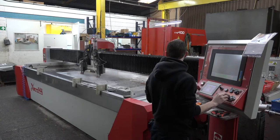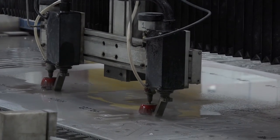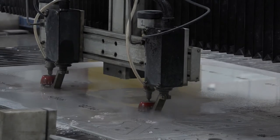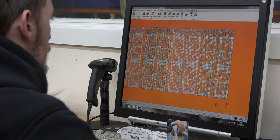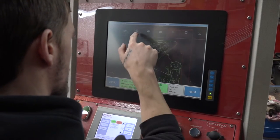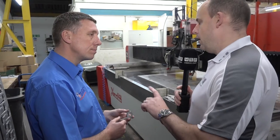The machine cuts every type of material — steel, plastic, tufnel, and more. The offline software, run from the CAD room, exports all the relevant parameters to the machine for whatever material is being cut. In practice, they may increase or decrease the speed from the software's suggestion to find the optimum settings for the accuracies they're trying to retain, since sometimes the software tries to cut too quickly.